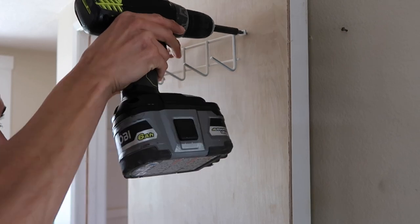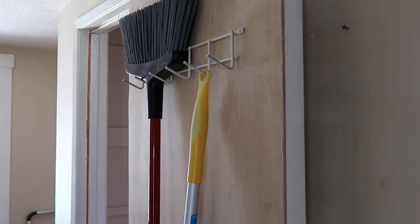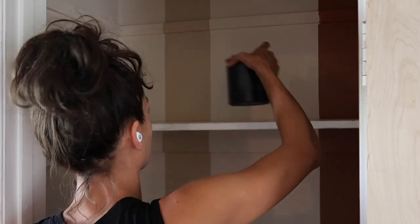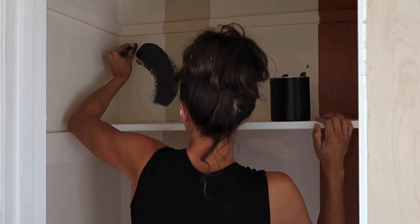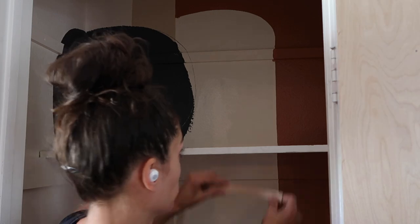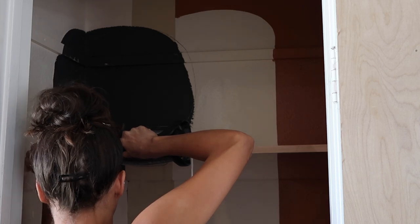You can see the saw marks on the side of the door — that's because I went in with my circular saw to make sure the wood I added was flush before installing it back onto the frame and adding a broom organizer to the door. I also tried to hand-paint a circle as a design element, and it just completely failed — my kindergarten teacher Mrs. Watermelon would not be proud. I'll be adding edge banding to the existing shelf to match the other plywood shelving I'm adding to this closet so everything looks cohesive.